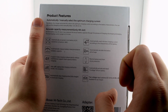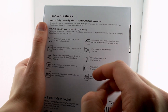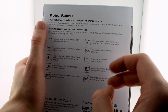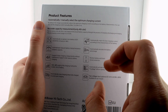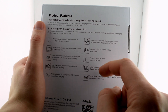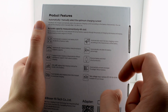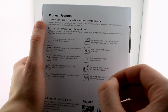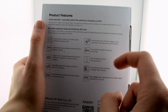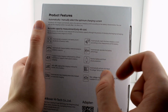There's a cool feature for zero-voltage batteries or batteries with a protection circuit. If you go below a certain voltage — if you haven't charged it in a long time — a protection circuit in those batteries will cut out so a flashlight won't drain it lower. The problem is some won't charge afterwards, but they say you can trickle charge and bring them back to life.